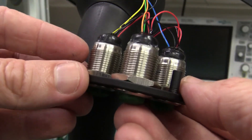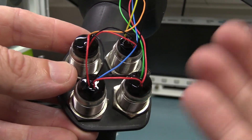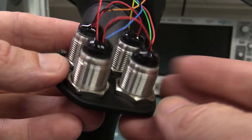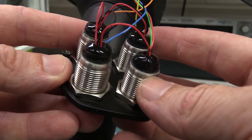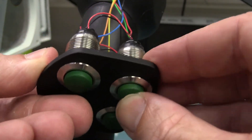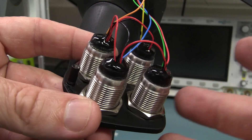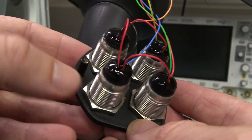So yeah, they're manufactured by Control Devices here in Sydney — their own Hall Effect sensor — because mechanical wipe contacts, to get 10 or 20 million operations out of those, it's a bit dodgy. So Hall Effect with no metal-to-metal contact — all electronic effectively — is the best way to get that reliability. Then you've only got to pretty much rely on the spring. As long as you can get the spring to do those 10 or 20 million operations, Bob's your uncle. And they're all ESD protected as well, as you'd expect in an industrial application.